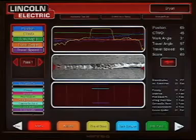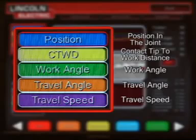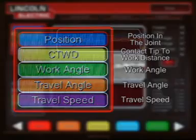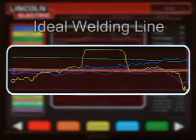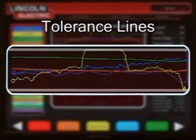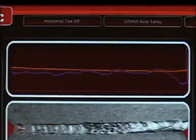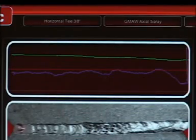The graph charts five different welding technique parameters: the position in the joint, the contact tip to work distance or arc length, work angle, travel angle, and travel speed. Ideally, all lines will be grouped together along the red line, indicating that the student is using the welding technique that the instructor has requested. All technique parameter lines should be within the white tolerance lines. If a student uses technique that is outside the tolerance lines, they will peg up against the top or the bottom of the graph. Each line can be turned off and on independently so that each can be evaluated and discussed during the training process.